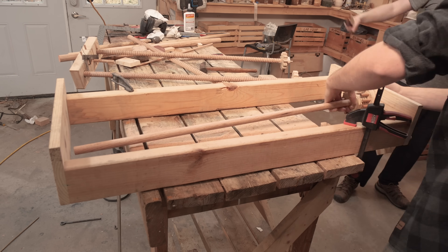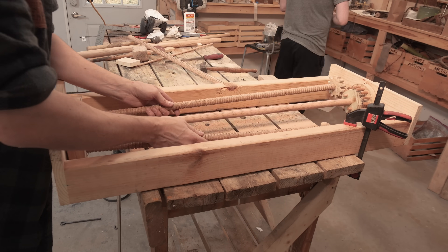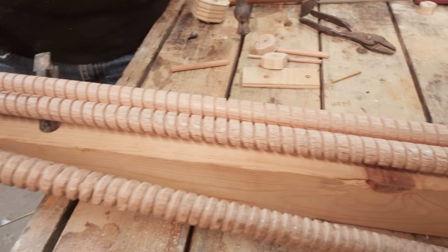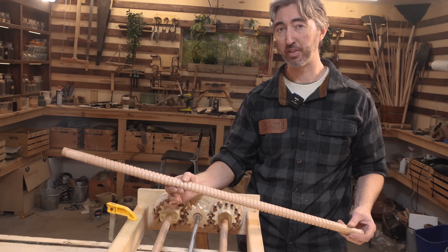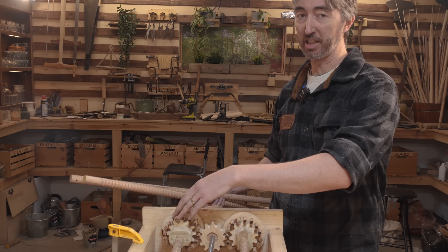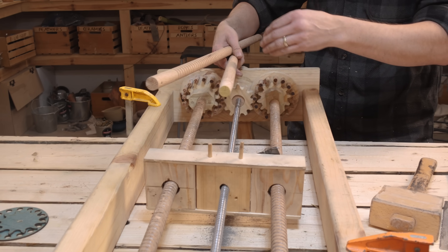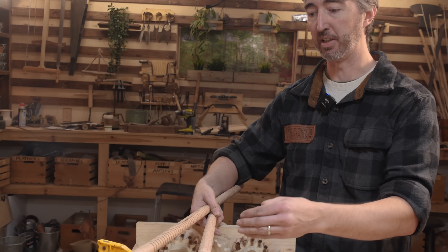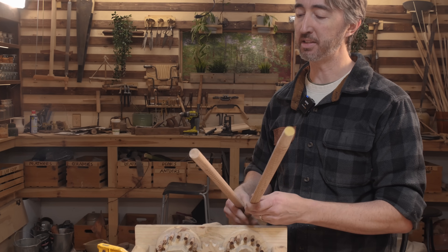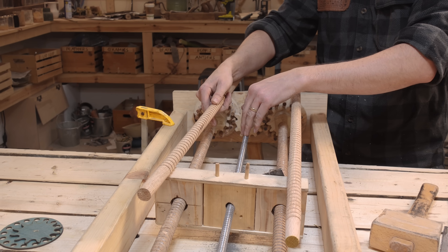This is our current state of the upgraded screw machine. The first step was using the machine to cut new wooden screws. However, once we finished cutting the screws, we had a critical realization. Because of how our gearing works, whatever the lead screws run at, the finished screw will actually be reverse-threaded. So if you use those to replace the lead screws, you're now cutting reverse threading.